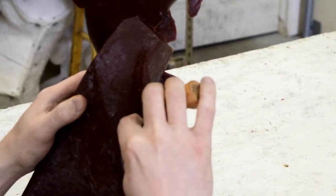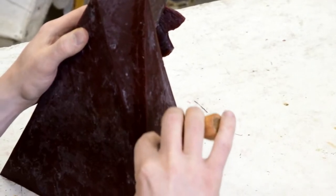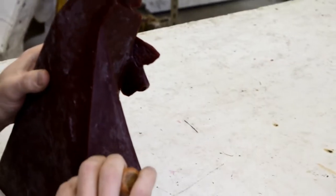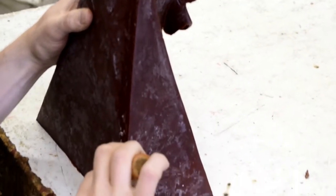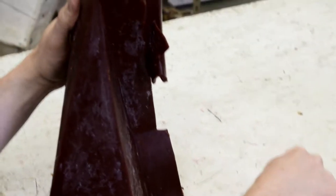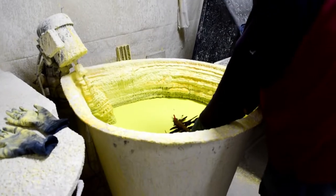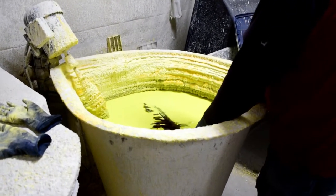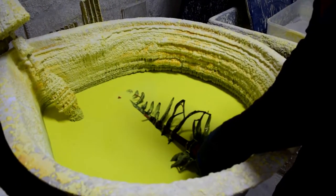The usual wall thickness of a wax is right around 1/4 inch. And to allow the slurry in the dip room to flow inside, a window usually needs to be cut into the wax. This can be welded back in later. Small waxes are grouped together on a tree for ease in handling and production. This is both safer for the casting and easier for those that work in the foundry.